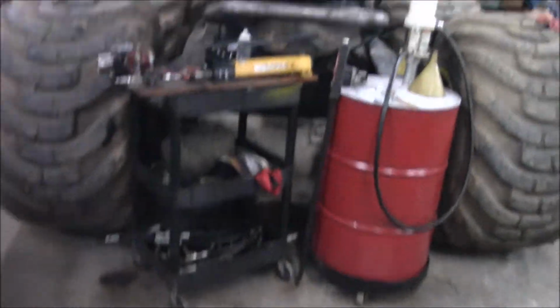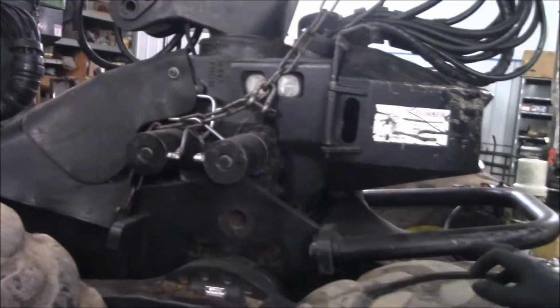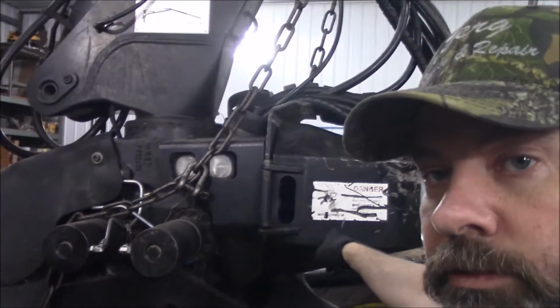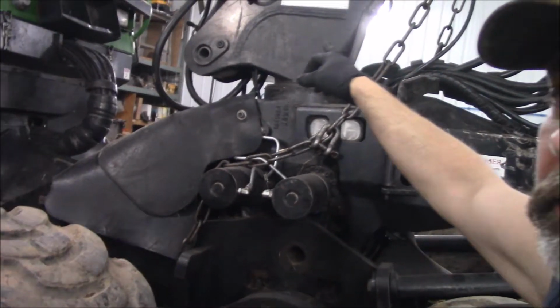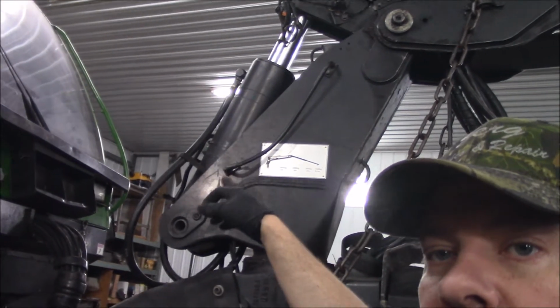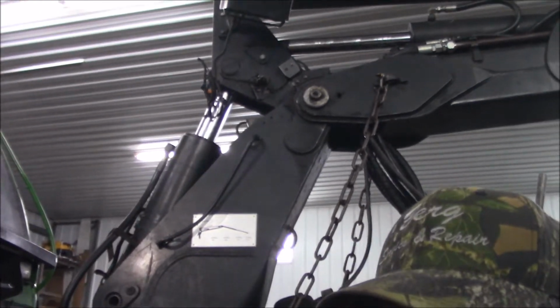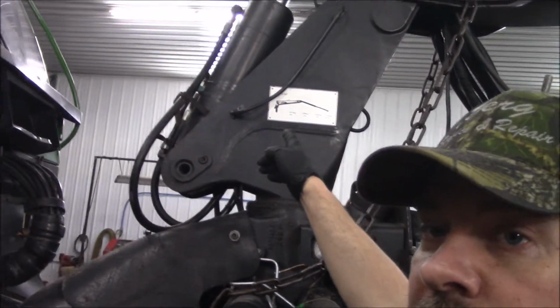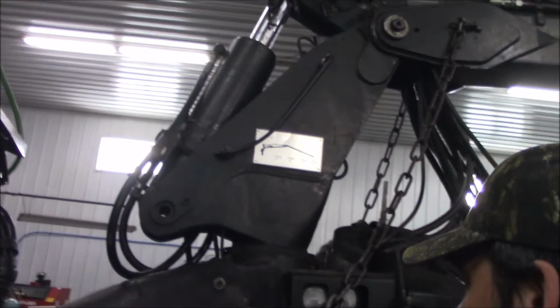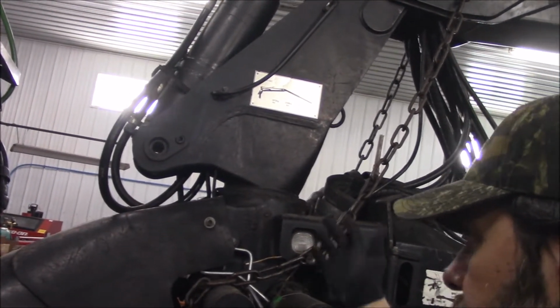And then for the rest of the machine, we got to open the valve cover here, the spools. There's some leakage going on there. We got to figure out what's in there. The main lift cylinder is coming out on this one. The tilt for the main boom is settling, and this carrier is getting to be, yeah, we're going to be taking that out and then we're going to repack that cylinder. And unless we've got an oil leak up there. He's telling me there's oil down here, so maybe it's a fitting or a hose that's letting it seep down. We'll figure that out.